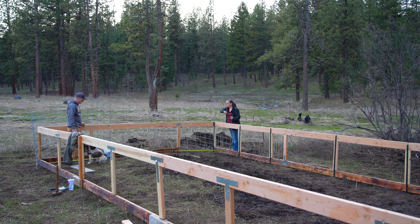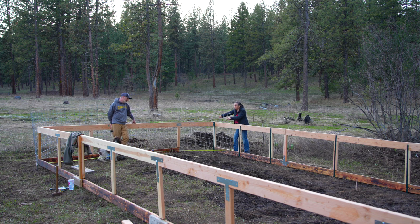Right. Like, we could make it. Because we're going to have to get 12-foot boards to do it. It'll make 10-foot, 8-inch boards. It makes sure it's 12-foot. So the 12-foot boards, 4x4s, we can cut, let's say, to 11 feet, which makes it 132 inches, and then put them up, and if it's standing up too tall, we can't get it to bend, then we just cut more off. Okay. But, based on measurements, 128, 129, I would say 130. So that we don't have to take it apart and do it twice.